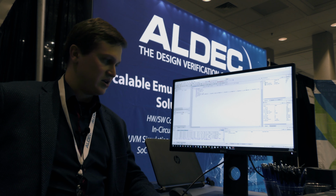We're also showing our HES UltraScale 1320 FPGA board. It features three Xilinx Virtex UltraScale 440s, and it's connected to a variety of high-speed interfaces, including PCIe Gen 3 up to 16 lanes, QSFP28, as well as Gigabit Ethernet through RJ45, and things like USB 3.0, USB 2.0, SATA, FMC, as well as SODIMM modules for memory. So this can be used for emulation as well as prototyping.